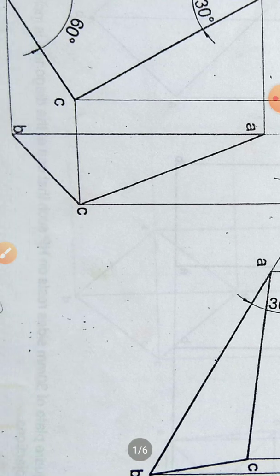The top view and front view — the front view just appears as a line. In the second position, draw a line at 30 degrees and place the first position front view on it — that is A', midpoints B', D' in brackets, and C'. Make the border lines bold with 0.5 mm thick lines. Project downward, and from the first position top view project towards the right. The projection lines coincide at points A, B, C, and D — make these four points with thick line to get the second position top view.